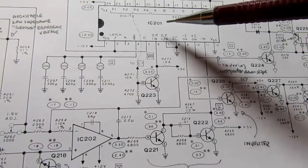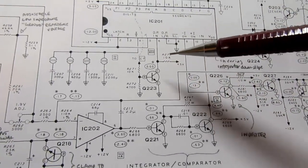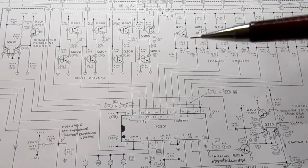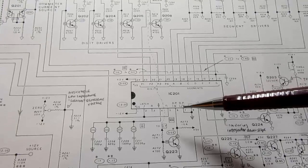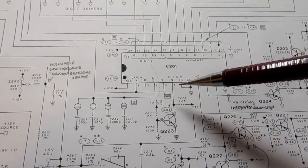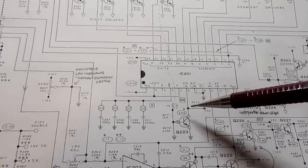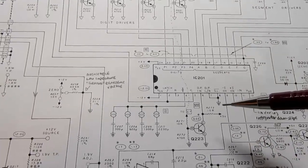The other thing that this IC controls besides the digits of the display is the position of the decimal points, because it provides a scanned matrix display driver functionality, and therefore the decimal points must be included in that scanned matrix, so this chip has to be in charge of the decimal points. Well, you could do it off board, but it'd be a lot more complicated, and the chip is designed to control the decimal points. But you have to tell it when you want the decimal points to be turned on and off, so the correct decimal point position is activated in the matrix scan that's under control of this IC.